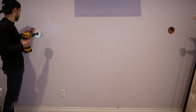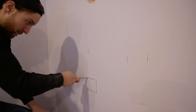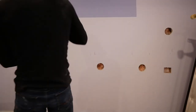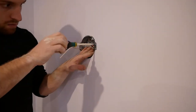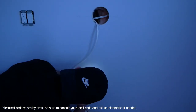The original plan for the electrical was to have wall sconces similar to my bedroom. I ended up changing this to pendant lights because I didn't like the overall feel of the wall sconces, but the wiring is pretty similar regardless. I start by cutting out both the holes for my lights and the boxes. At each side of the bed you'll have both a switch and a plug, and the switch will control the light directly above. I had to drill holes between each stud space in order to get my wire from one side to the other. I take a wire from the existing outlet to power up both of my boxes, then take a wire from each light box down to the switch box. I then install all of my devices and tie in to the existing circuit. Make sure anytime you're working on electricity you turn the power off.